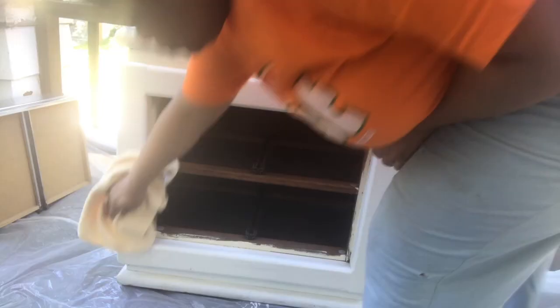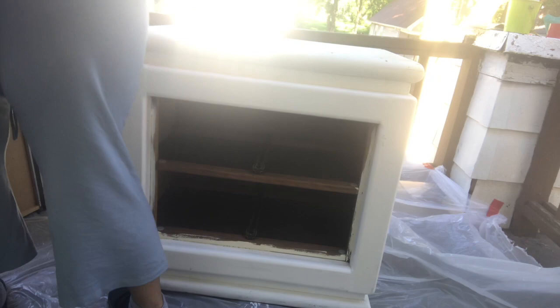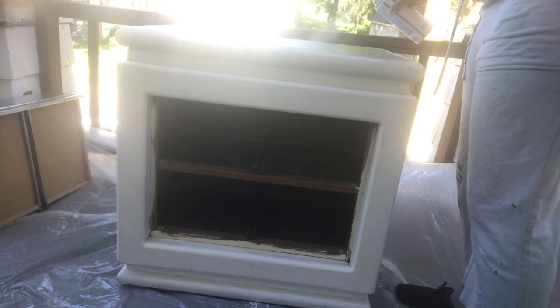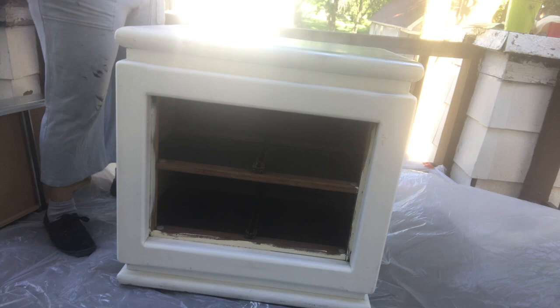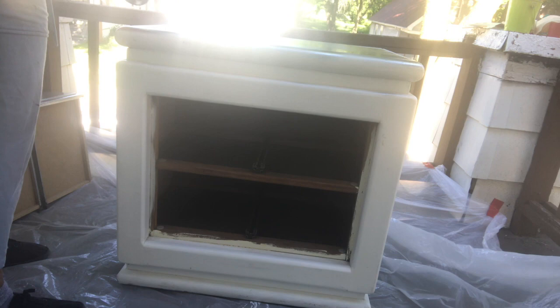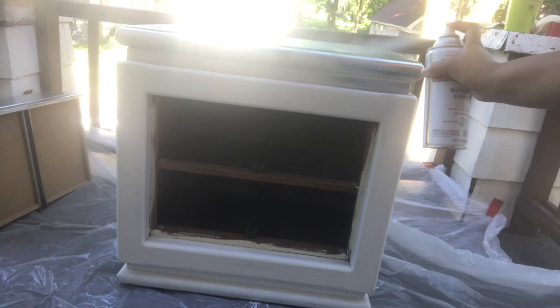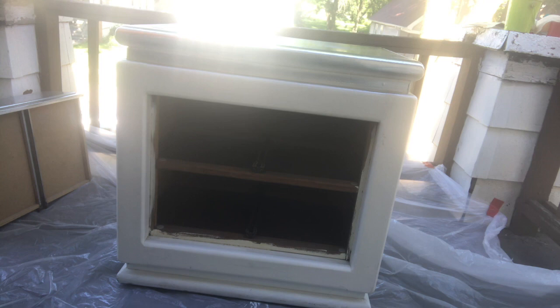After sanding I grabbed the spray paint, shook it up a little bit, then sprayed the top very well and the sides. This piece also took well to the paint just like the drawers did, because the white base helped the metallic paint adhere really nicely.